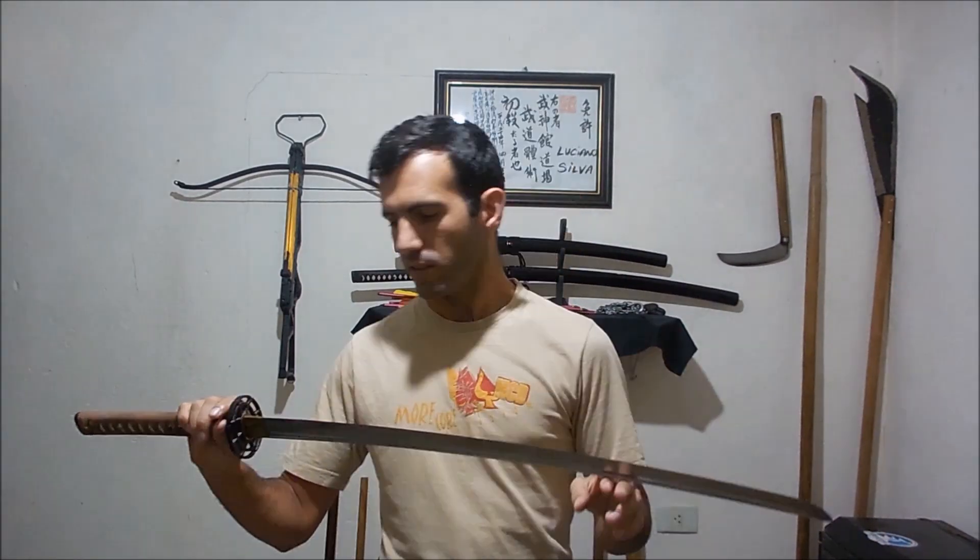Probably 1060 or maybe below — it's a kind of softer carbon steel. Another thing about the steel being very hard is the problem that it's more likely to break than to bend. It's a trade-off. If I use this kind of sword for training and I'm cutting a tatami rope, and if I hit with the edge without the proper alignment, I will force the structure of the sword. And if it is very hard, then the sword may break — so it's a danger for you.